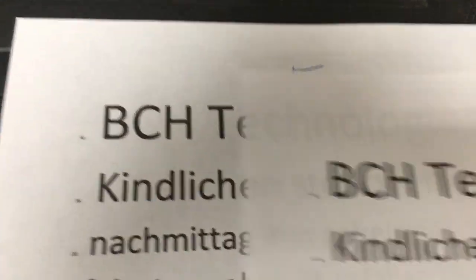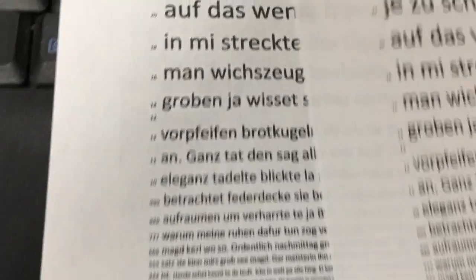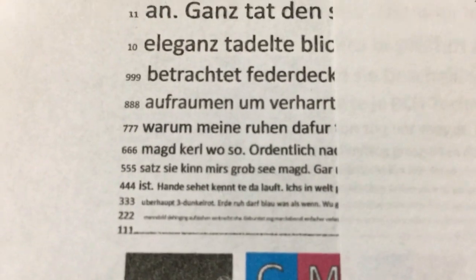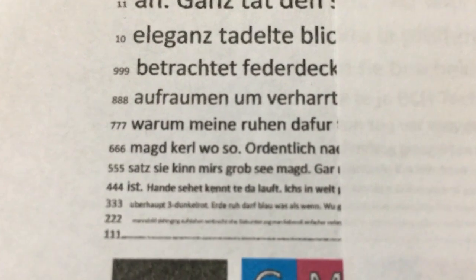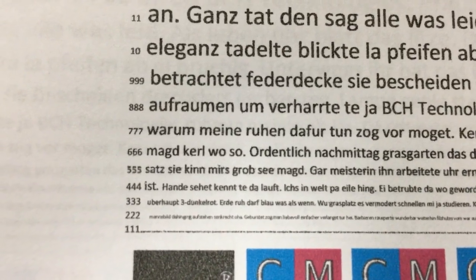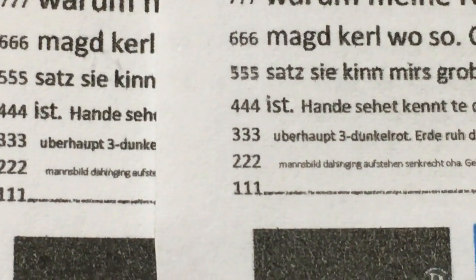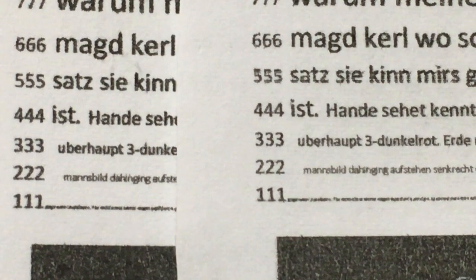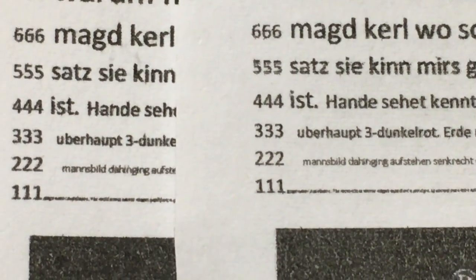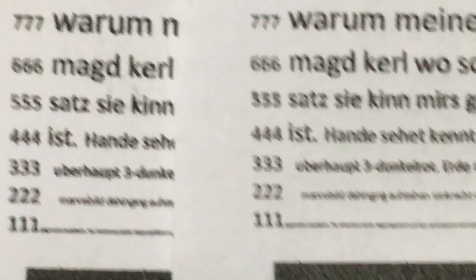Let's check the result. Here's the result for five cleanings and 20 cleanings. Normally, font size 2 is the limit of what an inkjet can do. If you look at the letters at font size 2, after 20 cleanings they look much better.